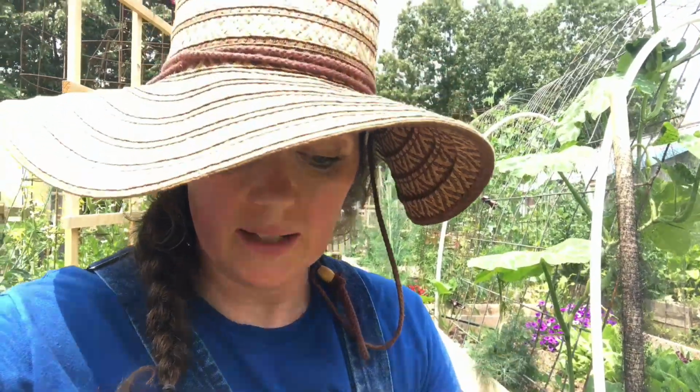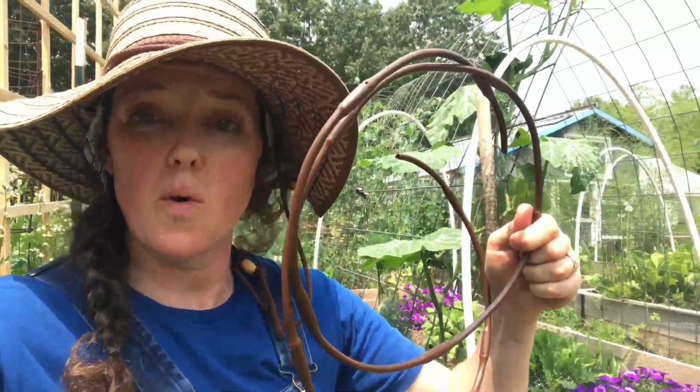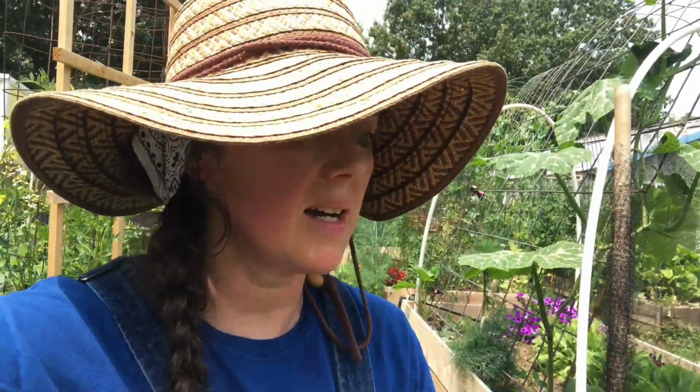Real quick, a really side note, if you want to go ahead and cut one to length and then pull out the rest and cut 4, that way you're going to put 3 down, and you're going to have another one as a pattern. You're going to cut 4 more, put 3 down, and so forth. That makes it much easier than trying to take the whole row down there and cut it. That way you've got them, you can just put them in.